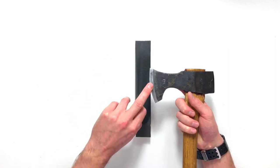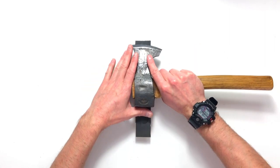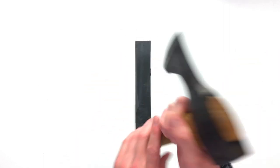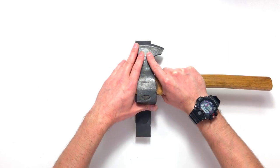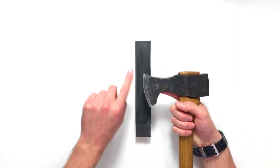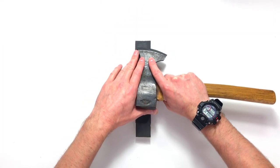I haven't got pen in there, but instead of being shiny it's just ever so slightly matte. I'm going to keep working in that same method — raise up onto the bevel, move my wrist slightly along towards the toe which is up at the top of the axe. Once I've reached there, I'm going to go from the middle to the heel and then flip it over. You'll be able to see if you pen this in whether you've hit the whole edge. I'm starting in the middle because that's where I've got the most bevel contact; if I start up at the toe there's very little to register.